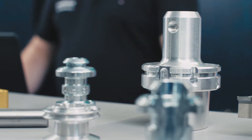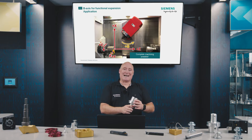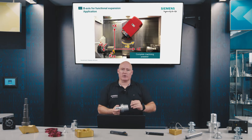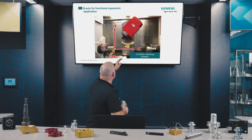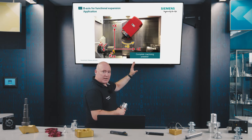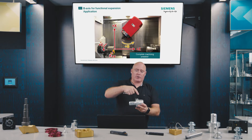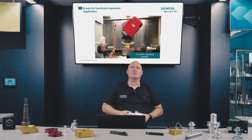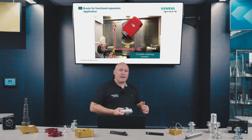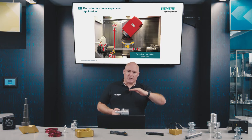In order to machine our example workpiece — in this case using an HSK-type tool holder, HSK Taper Size 100 — we will use a turn milling machine with the following kinematic constellation. Channel 1 is a milling spindle, the so-called B-axis, which rotates about Y and can be positioned at any angle to the workpiece, on either the main spindle or counter spindle. Channel 2 is a tool carrier — a tool turret — located below the workpiece.